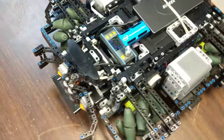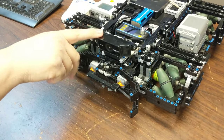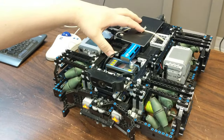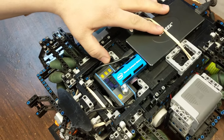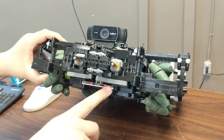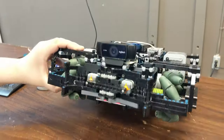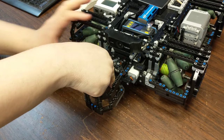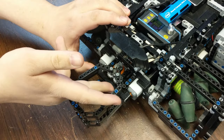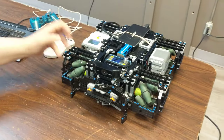This is built for our can-soccer competition, where the robot has to go out all by itself using just a camera to find a can and then pick it up with a gripper. To do that I have visual software on the computer which tells me where the object is based on its color and shape. When it gets near the object, there are IR sensors on the bottom — left, right, and middle — that center up the robot to grab it. When the robot gets close, it grabs it here; this bar gets pushed back to confirm the can is in the gripper, and then the robot navigates back to the goal to drop off the can.